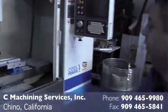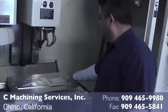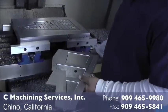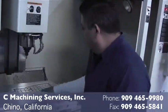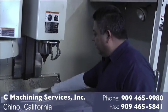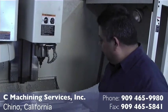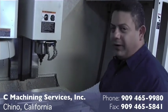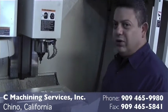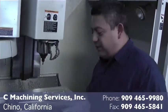It's also another CNC machine. We're going to make some parts with a vacuum system to manufacture this part. We hook up a vacuum system and this sucks it down, allowing us to machine the part all the way around without having to hold the part. So we have to use a vacuum system to suck it down — it holds it and then we machine the part.